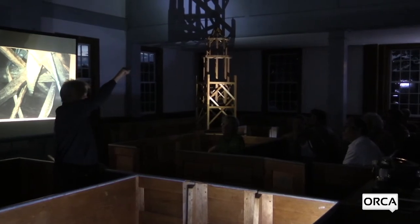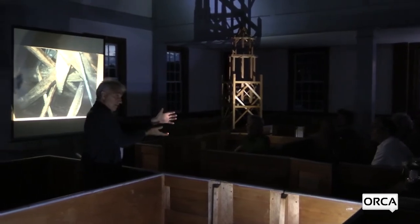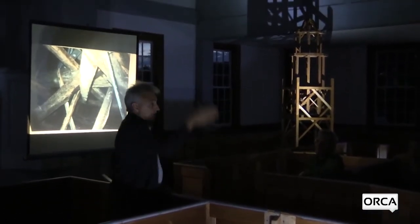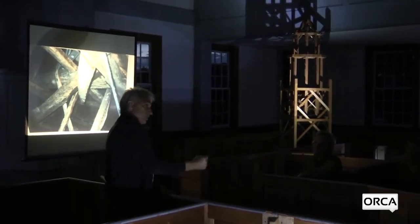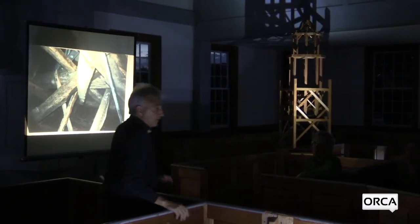The question is, if I had it down below, I'd start cutting down it until I got out of the rot. Gotcha. And then, if I thought there was enough to be worth it, I'd make a long scarf joint and probably even put wooden fish plates around it, and then drop in another piece into it and attach it, and have that piece have the carved stuff on the top end.